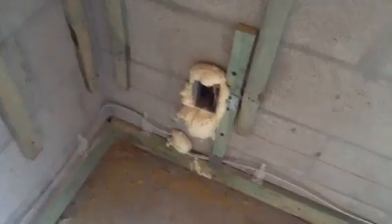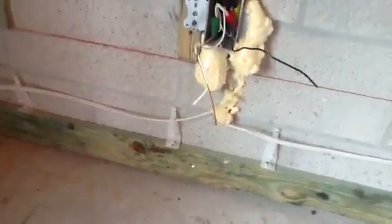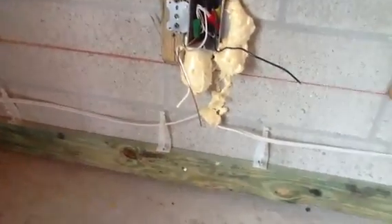This outlet — I always tell my guys it's like connecting dots. So we've run over here. You see the little hole with the foam? That's where we punched the hole. We just fed the wires up from the bottom inside the hollow block. Okay? That's one dot. We've taken it over here and run it to the second line. See how we've knocked another little hole in the bottom? Filled it up, punched it in. That's the second dot.